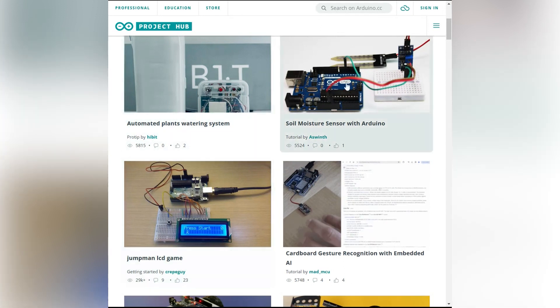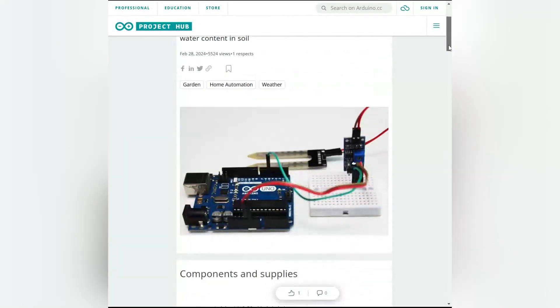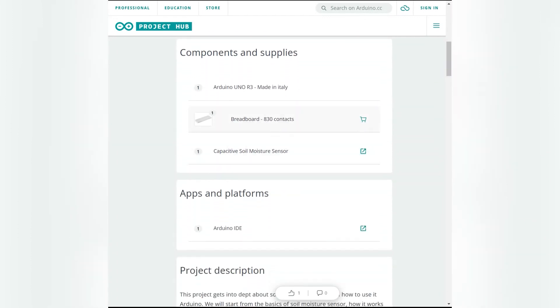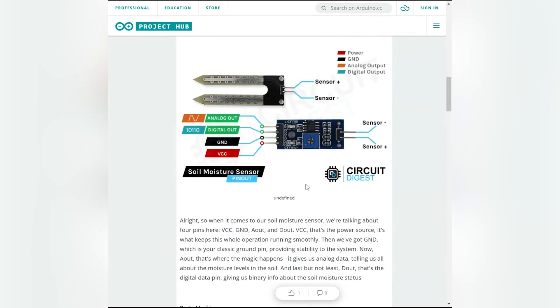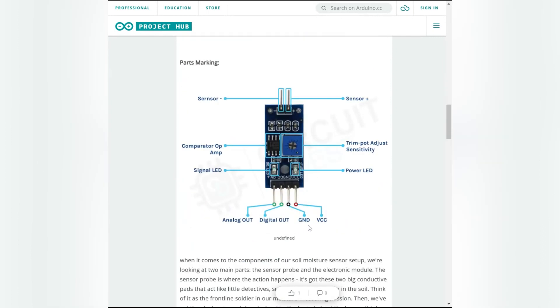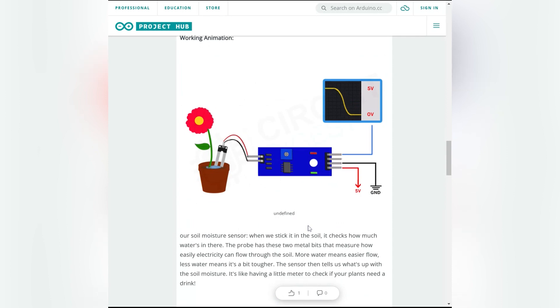For example, the soil moisture sensor — you can have a thermometer or a water reader on it, measure the soil contents, see how much water it has and how much it needs. The project will tell you the code you need, how to set it up, and explain what you need to do. It can show you the layout — okay, this pin will need to go to analog in, this pin will need to go to digital. If you have an LCD screen, you can see it saying one for water and zero for no water. They have all these examples and diagrams to make it super easy and visual for everyone to make their own projects.